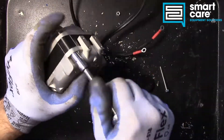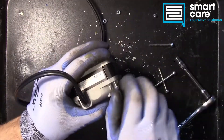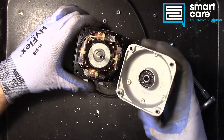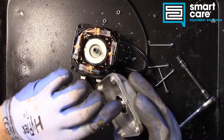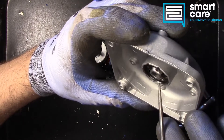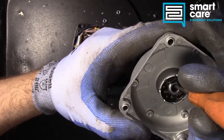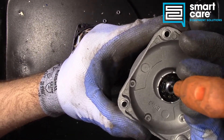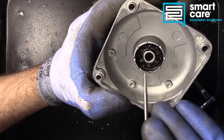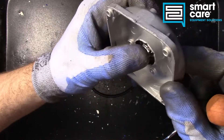So let's go ahead and open this up and take a look at how it's put together. Right away you can see the output shaft of the motor here is not a bearing — it's just a small bushing, and that bushing has been pressed in with a little retainer that lets it rotate a little bit so it can be perfectly aligned with the shaft. But it does not actually have any bearing surface — they machined this as if they were going to put a bearing in there, but there is no bearing. It's just a bushing.